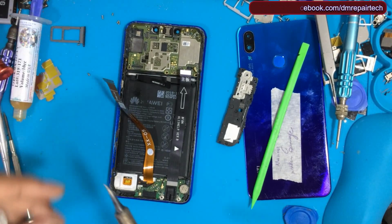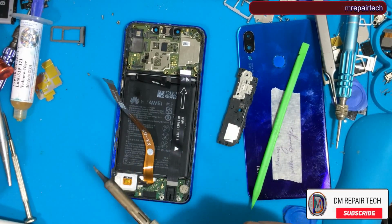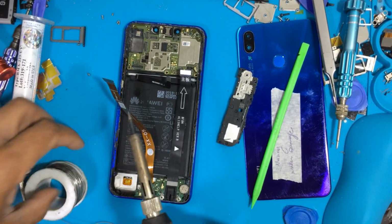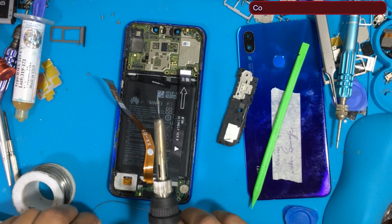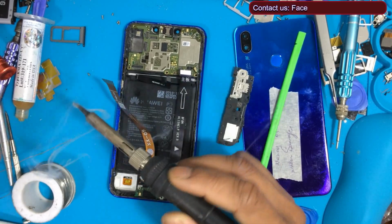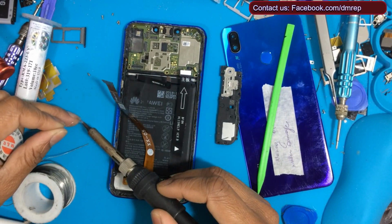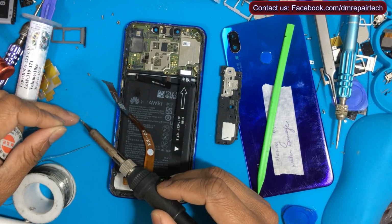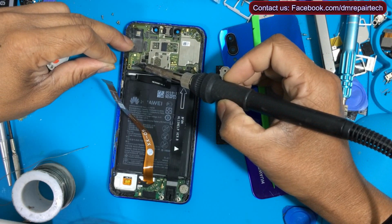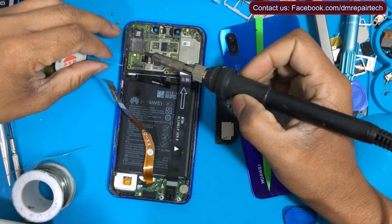After water damage, if your phone's LCD connector first pin is broken or has too much carbon, you cannot replace it easily, it is very hard to change the LCD connector. So there is no need to change the LCD connector; you can fix it without changing the LCD flat and LCD, using a jumper. I want to save my customer's original LCD without changing it, because it is expensive or we cannot find the original LCD available in the market.